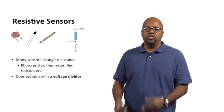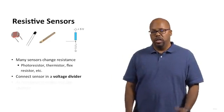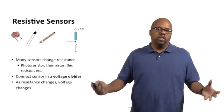You're connecting the sensor in a voltage divider, and the sensor itself, since it's a resistive sensor, is the top resistor in the voltage divider — though you can make it the bottom resistor too, it doesn't actually matter. As the resistance changes, the voltage changes according to Ohm's law.